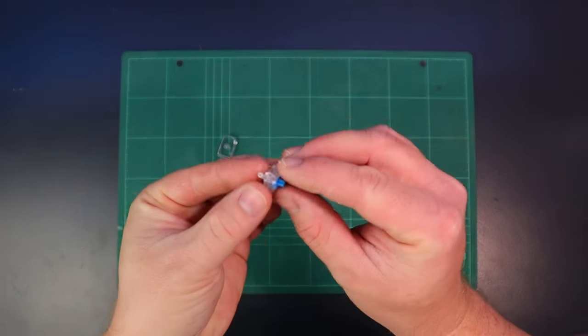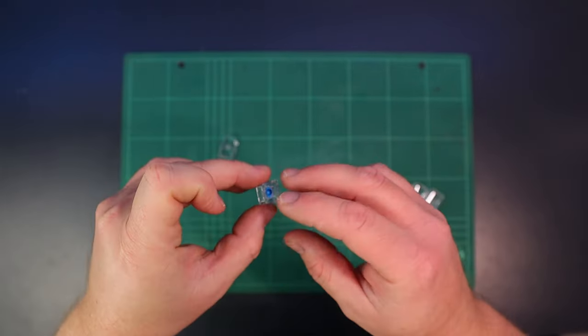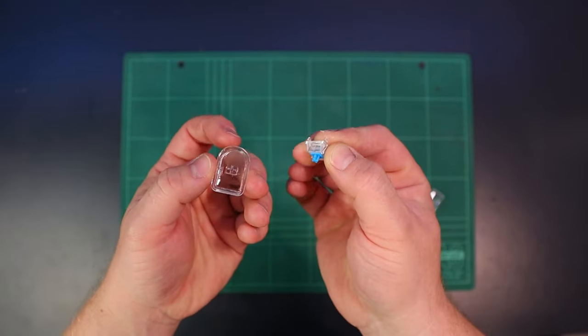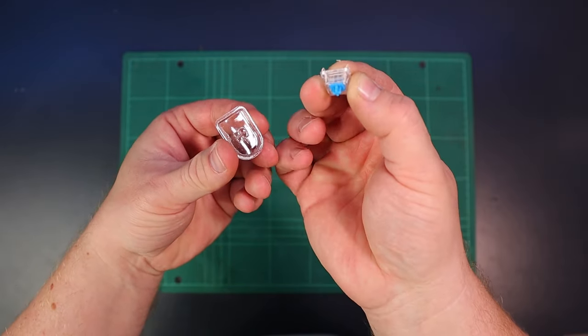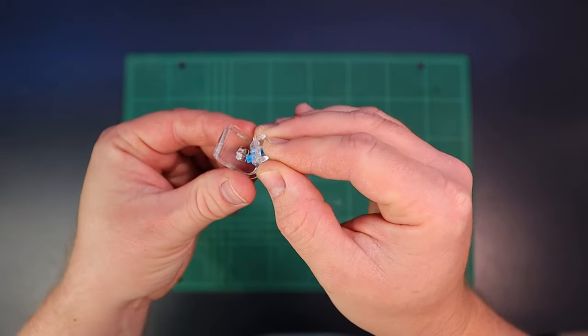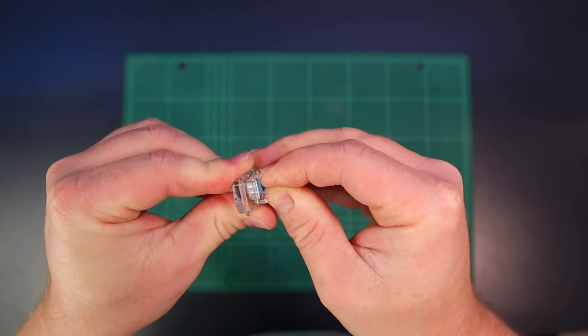I've designed the fret buttons to limit the travel of the mechanical switches to just after their actuation point, making the buttons much faster to press and release fully than a normal mechanical switch. The downside to this is that I need to remove the tops of the switches to fit the fret buttons, as I can't push them far enough on otherwise.